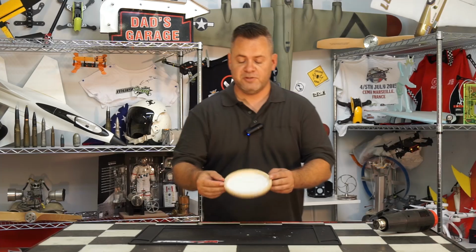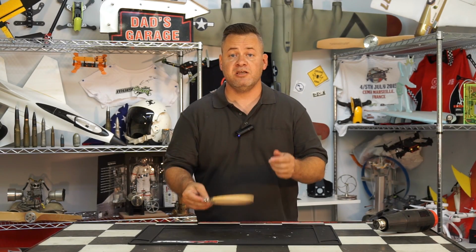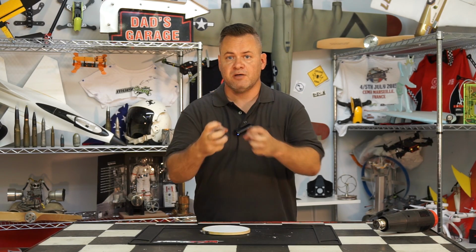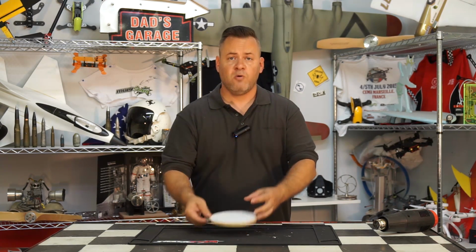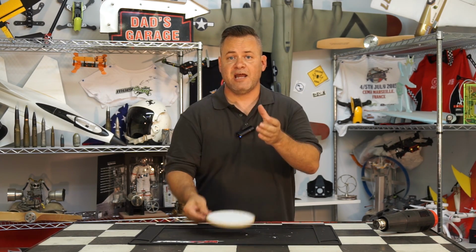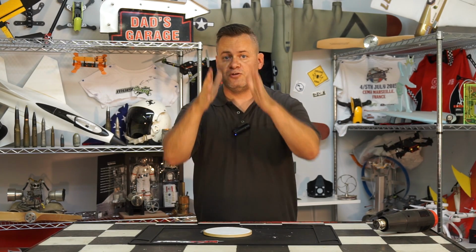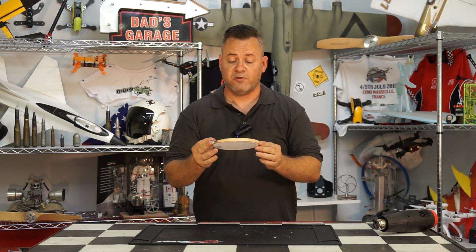Okay, so the finished hoop is going to look like this. The reason we need this hoop is if we just put the plastic heated up directly over it, it would just bunch up like wrapping for food or saran wrap. And we don't want that. It'll bunch up, create a webbing. So what we want is as it's drawn down, it actually is forced to stretch from the material up and around things instead of drawing into the material. And so that is why we need the hoop.